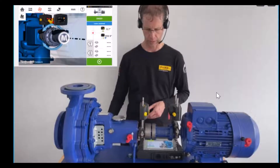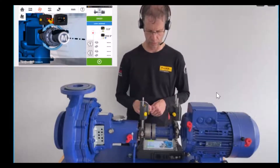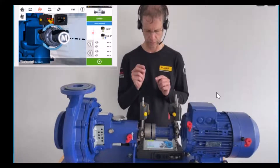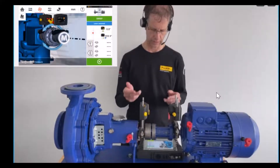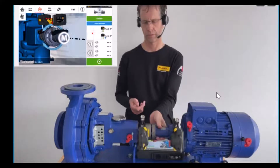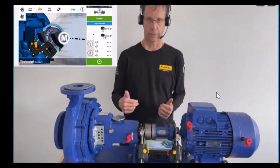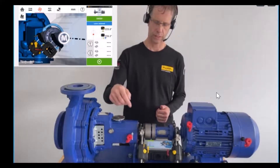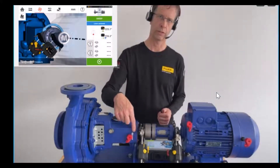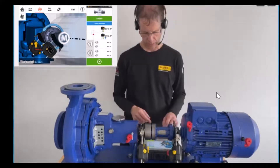I'm adjusting the laser with the help of that screw. Now you can see the laser dot is completely only red without any fan — the laser is centered. In order to start the measurement, go to the far side. I'll subsequently turn the shafts and sensors in machine direction, indicated by the white arrow.